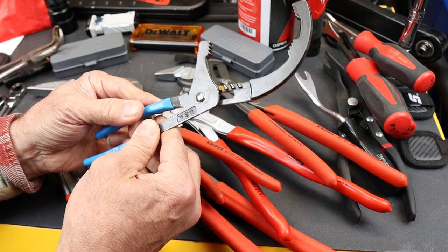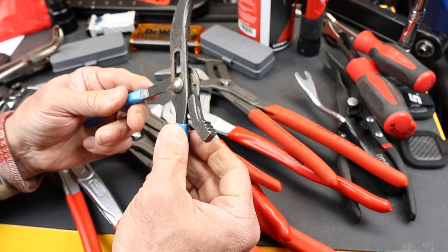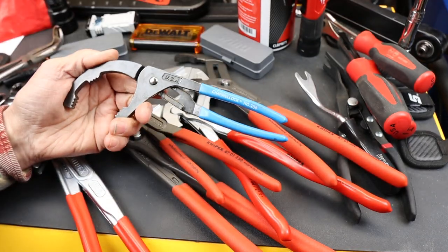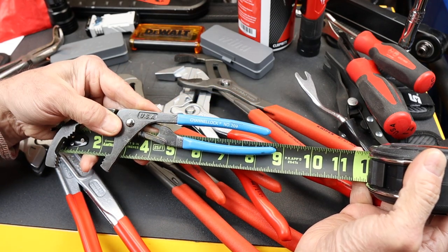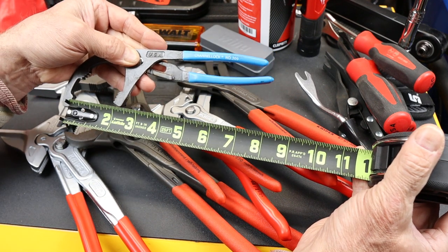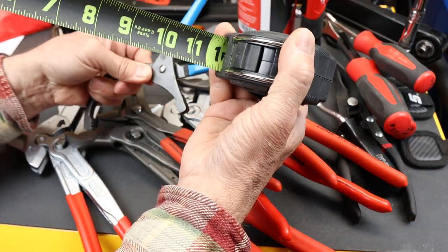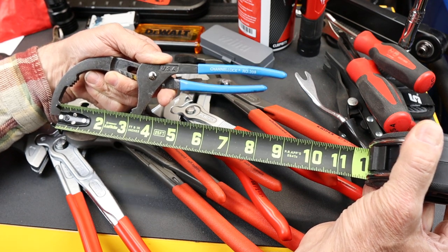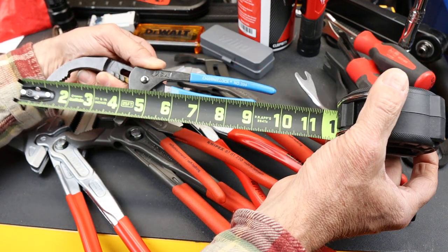It's a real basic tool — basically a tongue and groove plier. You can see it's still rusty from being all wet while I was working; I've got to clean it up. It has an overall length in its shortest position of just under nine inches. The jaw opening at its smallest is around two inches inside. If I open it up and slide it down, the jaw pushes three inches edge to edge, and in that extended position the tool is about nine and a half inches overall.